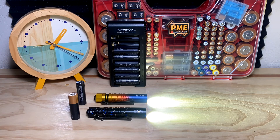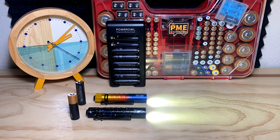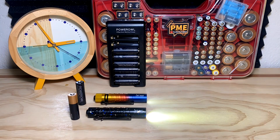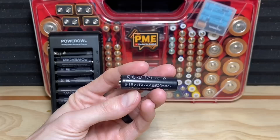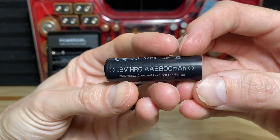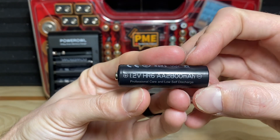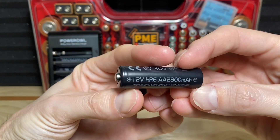Here we're looking at the runtime and output comparison with two different flashlights — we've got the Power Owl in the colorful one and the Duracell alkaline double-A in the cosmic-looking i5t from Olight. As you can see, there's a difference both on paper and practically between these two batteries. Fun fact: the milliamp-hour capacity of the Duracell battery according to Google is about the same as what's claimed on the Power Owl. Testing is complete and unfortunately we did fall shy of the 2,800 milliamp-hour claim, hitting about 2,100–2,200 milliamp-hours rounding up.